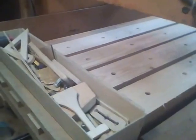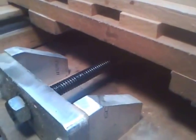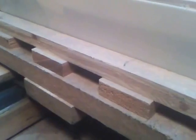It's a moving gantry, moving table setup. You can see the end of one of the screws for the X axis here. I actually use ways to move the table. The ways consist of a piece of aluminum underneath that rides on this board, and this board is greased — makes it slide pretty good.